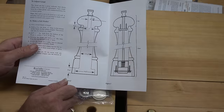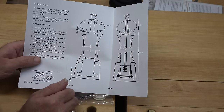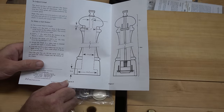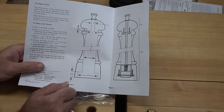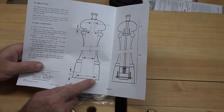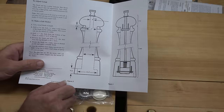And for that, we're going to need a 1 3/4 inch Forstner bit. So we're going to head over to the lathe. I'll set a drill chuck into the tailstock with a 1 3/4 inch bit, and we're going to drill this first entry hole of 1 3/4 inches, 9/16 of an inch deep.